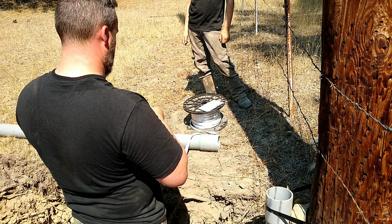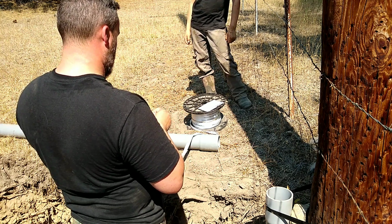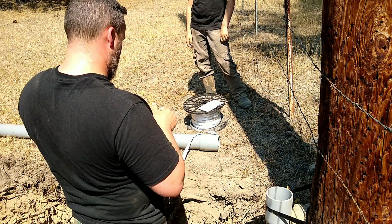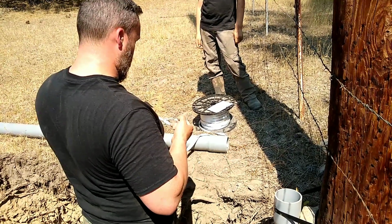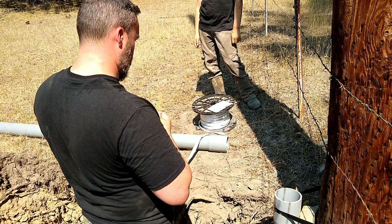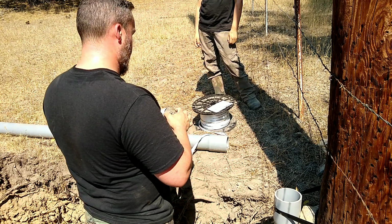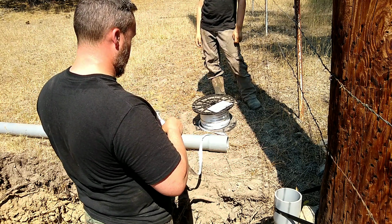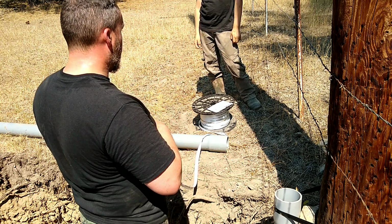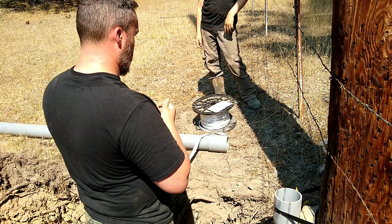Instead, what they normally would say to do is to connect everything, and you're supposed to put a little piece of twine and feed it through, maybe with a heavy duty shop vac, and it'll suck your twine through it, then your mule tape. The mule tape is for the power company to connect their wire, and it's strong enough to pull their wire through the conduit. So we're going to try it this way. We'll just see if it works.